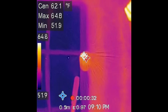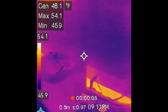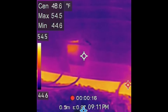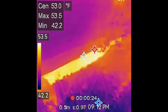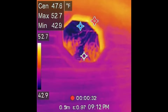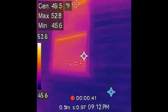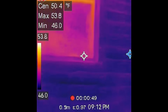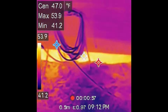Looking up above, there's an ethernet switch and a security camera. Now looking at the back of the house — it's not real cold out, but you can see where the foundation is. The orange down there is the concrete block right above ground level, and there's a little power transformer on the wall. Looking at a window, you can see where heat is being transferred. This is really useful when it's very cold out — you can look at your windows and see if you're losing heat. The colder it is outside, the easier it is to detect any heat loss.